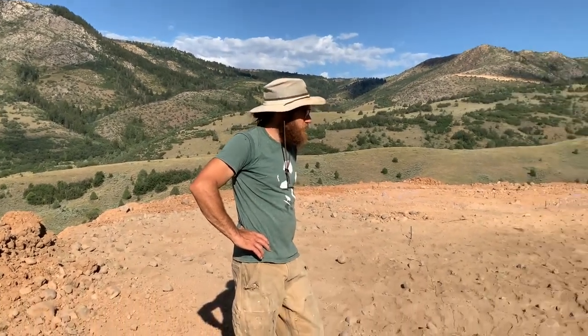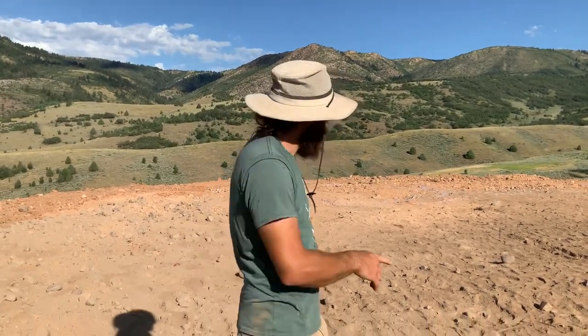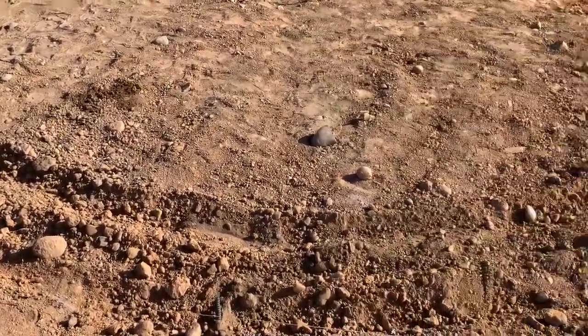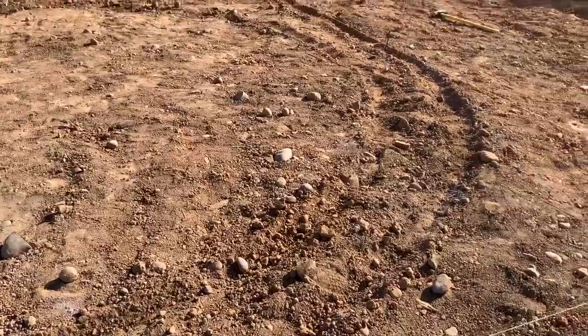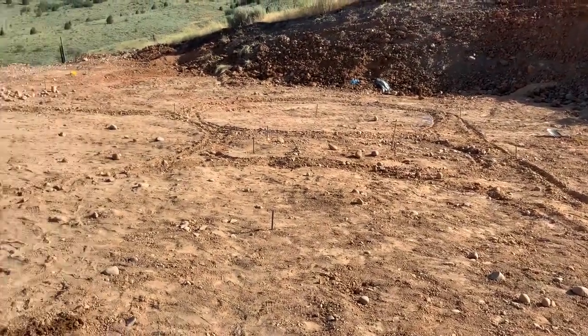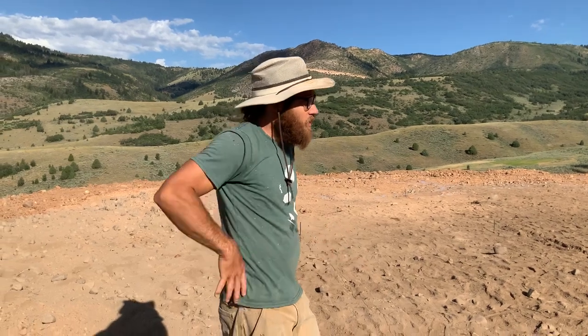We had talked about maybe trenching this whole thing by hand, which is possible, but I think it'll take at least a few more days than if we use the excavator. Especially because down in this corner over here, we have to get down to at least four and a half, five feet deep — that's really the significant situation here. The other decision that Michael brilliantly came up with was: why don't we use a 12-inch scoop instead of a 24-inch scoop? That way we can really get the nice curves and we're not wasting time and energy making forms for the whole two feet of foundation.